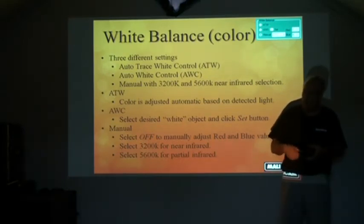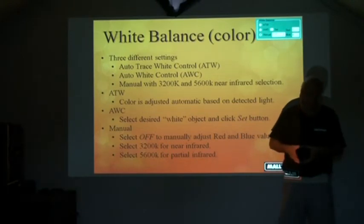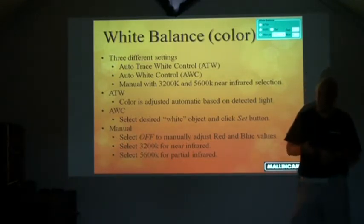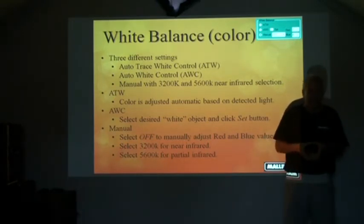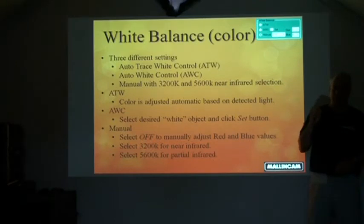If I were to think of a camera with a lens that had three different colors on it, you remember the War of the Worlds, where the alien had three colored lenses? I thought that was so cool, the RGB lenses on the aliens. One third of the lens is going to see the red, one third the green, and one third the blue. So for any one particular color, you're only using one third of the size of the lens. You're kind of doing the same thing with a CCD imaging chip when it's color. With a black and white one, you're using the entire pixel to read the black and white pixel. An interesting note though: because your eye perceives that color gives you more detail, people will think color pictures show more. But in actual scientific fact, black and white pictures are going to give you more detail because of the technology. It's just the way it is.